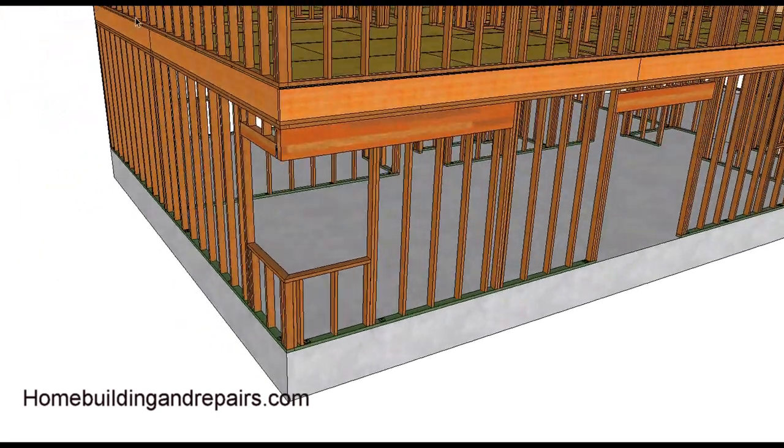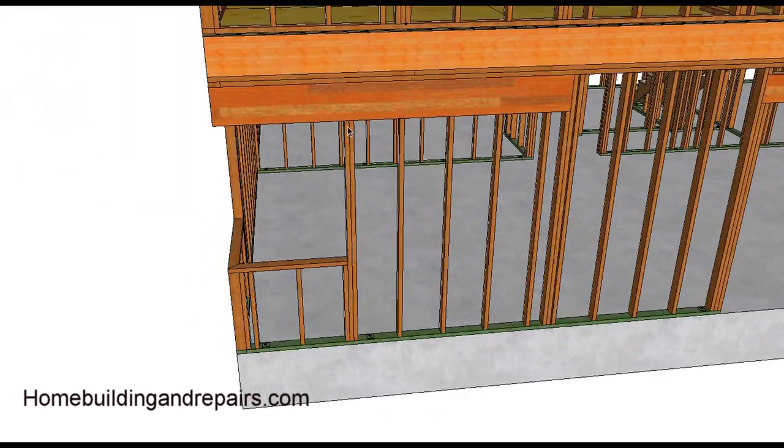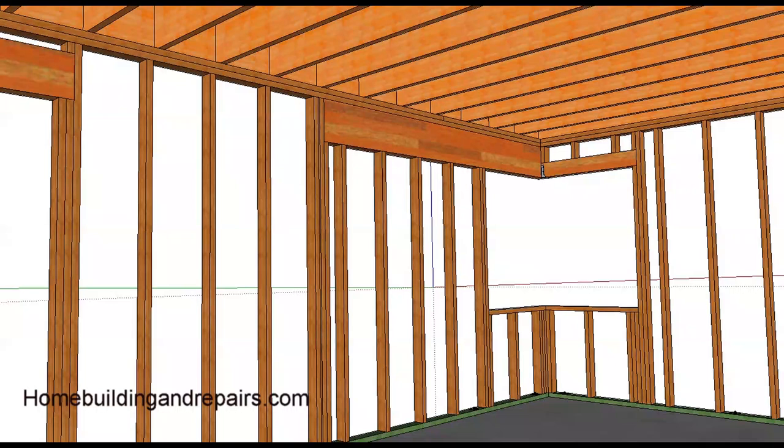You might not need a 4x12 or a 4x10 might do. You simply cantilever it like you would any other cantilever — one-third of the span can extend out, two-thirds back. So if this is a three-foot window opening, this beam needs to go back at least six feet.